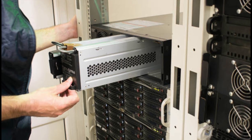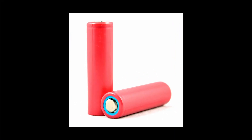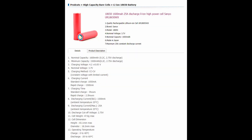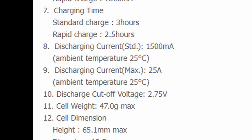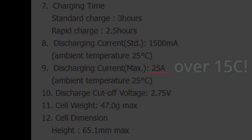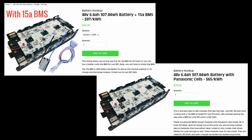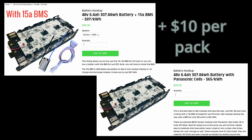What's also interesting is that these cells only ran for a few minutes at a time in their previous application, so they needed to be capable of extremely high discharge for their size. The Panasonic cells used in these packs can safely discharge from 100 to 0% in as little as four minutes. In theory, you could run a well pump off of only a single one of these packs — if you had a proper 100 amp BMS. However, I'll be using six of these packs for added capacity, so I'm more than happy with the 15 amp BMS they include for an extra $10.